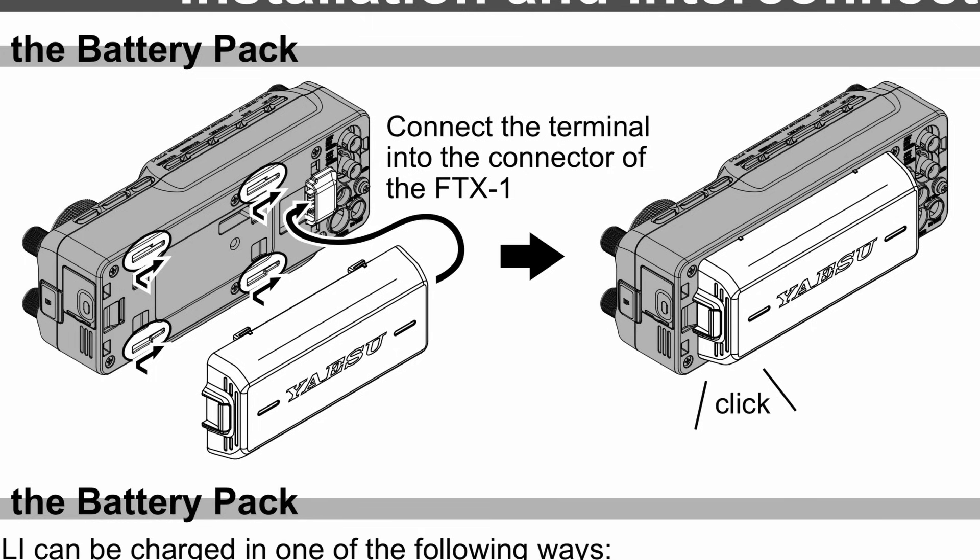The 6.3 hour battery lasts for ages — you don't need to worry about a backup battery. I turned the power down to five watts because although it's capable of six watts, there's not much difference between five and six watts and it saves a bit of power. It's very easy to set up. I've got a VSWR of about 1.2 to 1.3:1 at resonance on the CW end of the band, and working up towards the phone end it rises to about 1.8 to 1.9 near the top — and it still delivers full power.